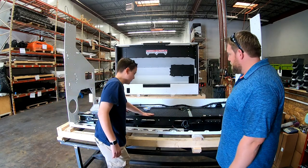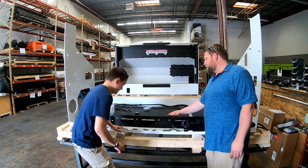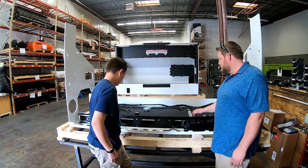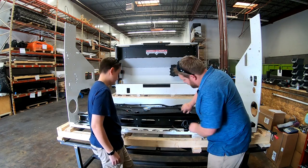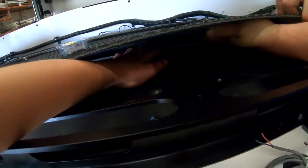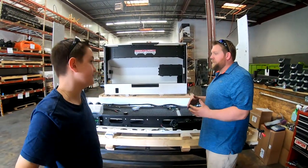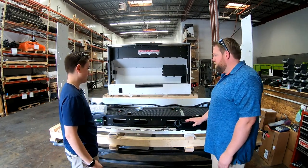This part here is almost like a treadmill — it's exactly what it is. There's a piece of plastic underneath here called UHMW, ultra-high molecular weight polyethylene. It's just a really dense piece of plastic under here. It actually has a V-groove. That V-groove is one of the things that keeps this whole system aligned, allowing you not to have constant maintenance on the system.